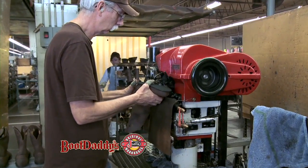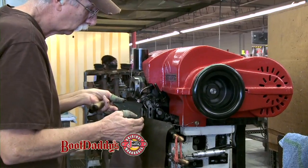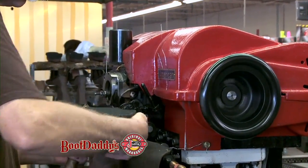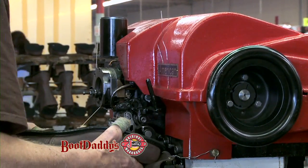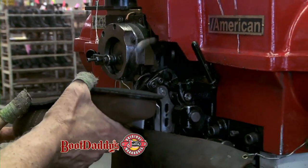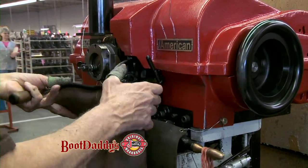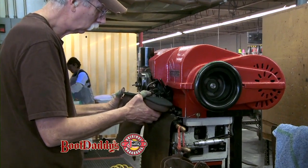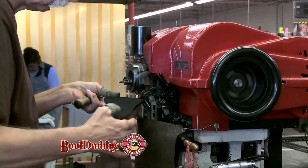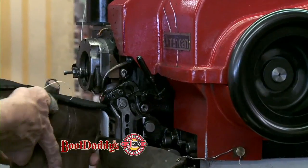Brandon, I remember this fellow from a year ago when we were here last time. I was impressed not only with how he was able to work that machine, but we talked to him, and he's been here a few years. He's been here about 28 years to be exact. What's he actually doing, Brandon? Stitching the actual midsole to the welt of the product, all the way around. You've heard of it called a Goodyear welt construction? You're looking at it. Goodyear welt construction. As you see on a cowboy boot, for instance, what we're wearing right here, this is called a 3/4 welt. Yeah. And you're only welting 3/4 of it. Goodyear welt means you're 100% all the way around it.